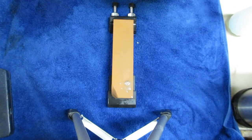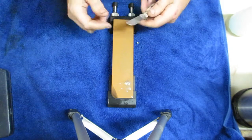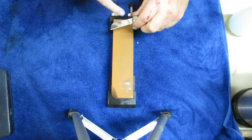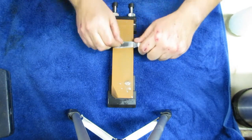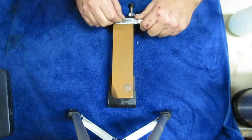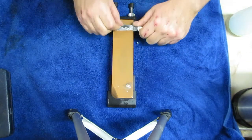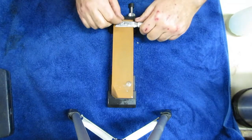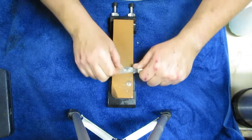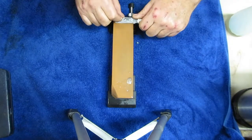Dude, that already rolled that burr. I want to go just a little bit more. Let me see what this side's. When you're sharpening a blade, you want to try to keep the bevels the same thickness, and that's why I'm going to continue to. This isn't quite as wide as the other side, so I'm going to go on with this. But you're going to find as you sharpen that there are things you like. Like I like these old India stones. I prefer them for the low work, the grunt work, and I like the Arkansas stones. I prefer them on knives and tools.